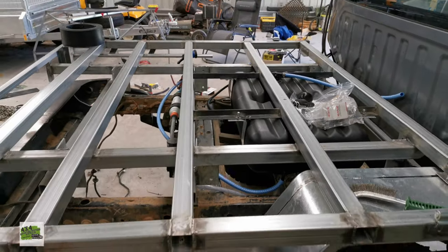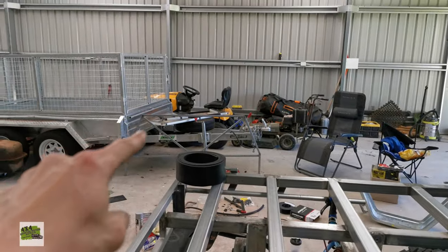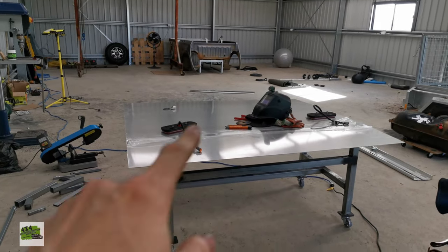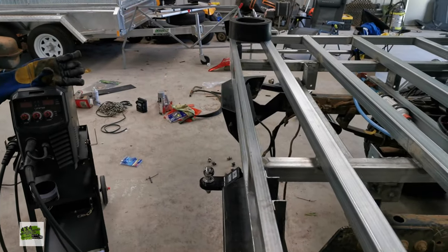The tray is 90% completed. As you can see, it is fully welded. Headboard is there, waiting to be put on. 2.5mm Ali sheet, picked up the other day. Rear combination lamps, Deutsch plugged, load resisted. So plug it in, put it in place.